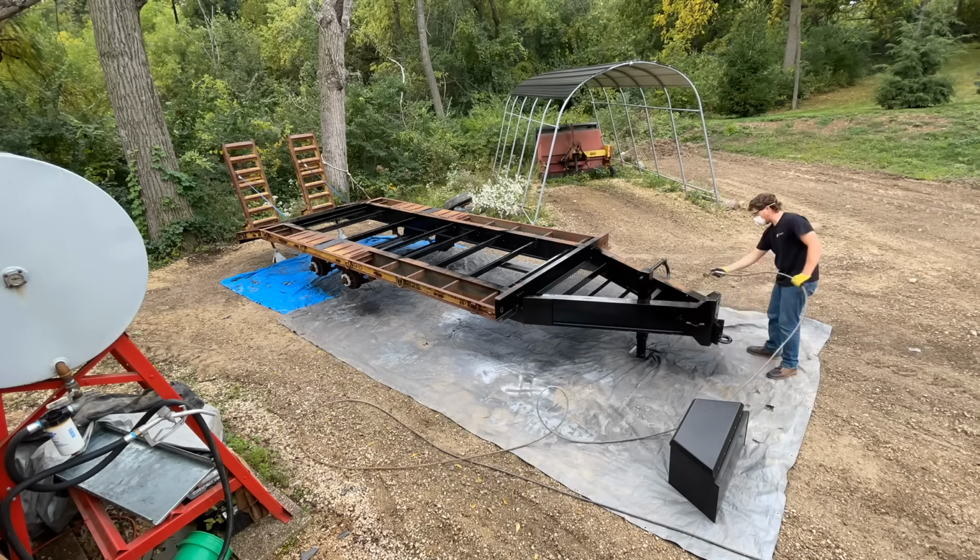And on these junction boxes, they're actually labeled with what goes to what, like left signal, right signal, stop, aux power. And from the factory, they're all bolted to these lugs. And I was like, well, why do I trust what they wrote and how they wired it? And sure enough, I put my test light on it and went to my truck, left signal, right signal, stop lights, the running lights, and not all of them were actually wired correctly to the correct corresponding lug. So I switched a couple over and now all the lights are working just how they should be.